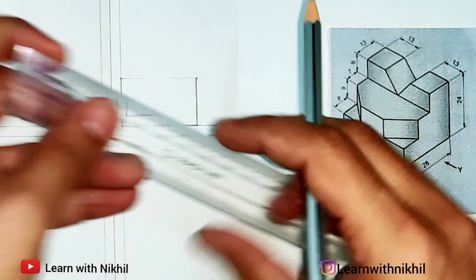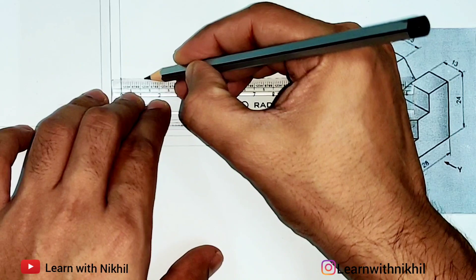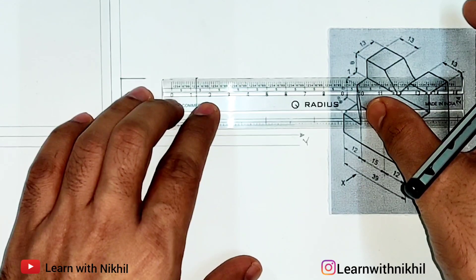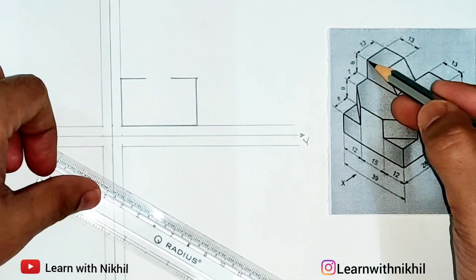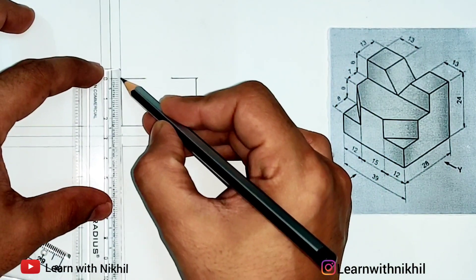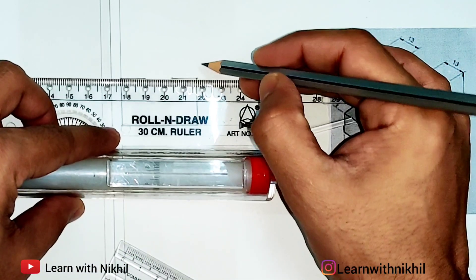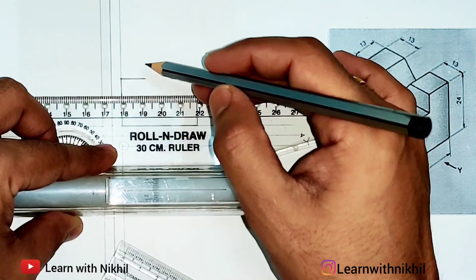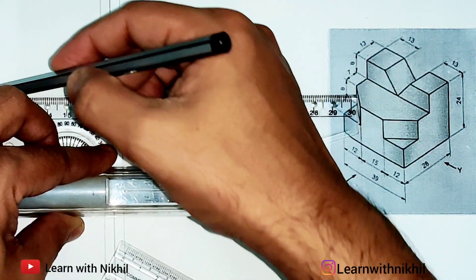As you know, at the center there is a cut part. From both the ends there is a dimension given that is 13 millimeters, so 13 millimeters here — dark line — and here also 13 millimeters dark line. Now the cut part is at the center, and the height of the cut part is 8 millimeters, that is given. So from here 8 millimeters below I'll mark a point and draw a light line there. You can extend it towards the side view also — later we will require those lines, so I'm already extending to the side view.